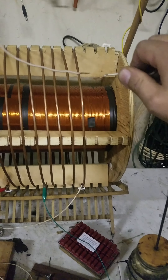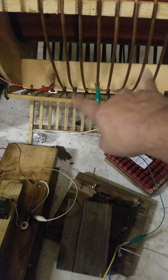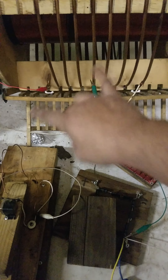Why is this happening? It doesn't work with just a standard lumped capacitance discharge standard Tesla coil setup, with the secondary going to the ground. It doesn't work when the secondary is going to the ground or anything. I get a little bit of induction into the secondary — I could probably get maybe half an inch of a little plasma arc through there, nothing significant at all, because most of the energy is going straight to ground through this center tap. Now, perhaps it's a push-pull configuration, because we have the hairpin configuration here with three nanofarads on either side of the 5k output. And we have the magnetic quench gap that's directly shorting the transformer output before the two series capacitances, which are driving this primary coil, in some form of push-pull configuration it seems.